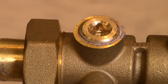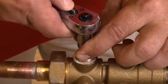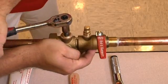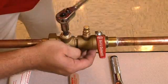Next we'll want to remove the plug in question. In this example, our half inch bypass plug is in need of repair or replacement. We want to take our allen key fitting and socket wrench and fully remove the plug. Make sure you hold back on the valve while turning the wrench counterclockwise.